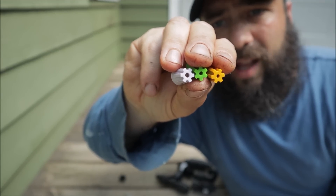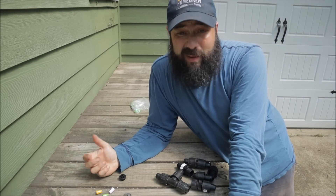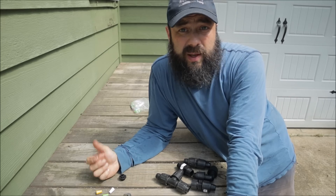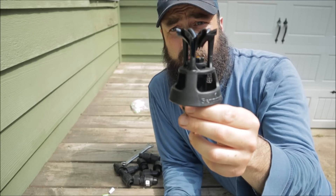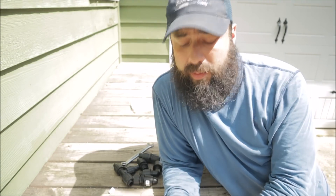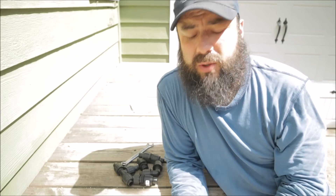These are the different colors — the gold, the lime, and the lavender — and the hole sizes are different. I found that when I was trying to put this together this information wasn't just laid out; there's a lot of research involved. I also contacted the company Senninger and asked them some questions — they were very helpful, so they are approachable if you have questions. You can buy wobblers with different colors and then buy extra nozzles too. Right now I'm using the gold, which is the smallest size opening — that's the number six gold, the number seven green, and the number eight lavender. They'll throw more water and throw it a little bit further; start with the smallest one and work your way up.